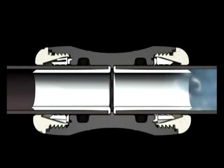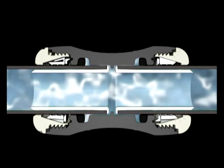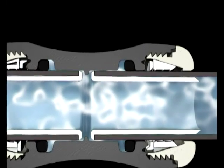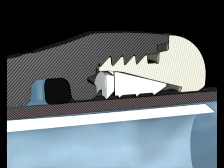As the pipe is pushed into the fitting, the grip rings engage and the O-ring seals. On pressurization, the pipe is pushed away from the centre of the fitting, but the first bite grip ring pushes the main grip ring into the cone of the nut, securely gripping the pipe and preventing any further movement.